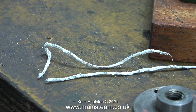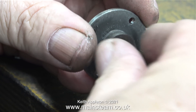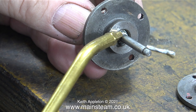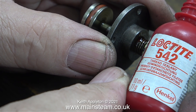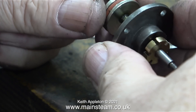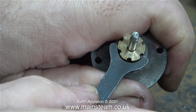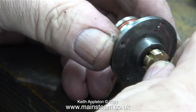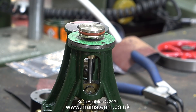The last piece of gland packing that I used was a bit short so I've cut two slightly longer pieces. I'm not going to show the process in its entirety as I've shown that previously. Here I'm fitting the gland nut in place, first tightening the gland nut and then backing it off slightly. Here I'm applying some oil, and with the help of the oil the piston rod moves very freely in and out of the gland. I'm putting a small amount of Loctite 542 on the threads — this is not to seal them particularly, it's just to tighten them up and stop the part from working loose when it's in service. That's one down. Here's the other gland with the unevenly machined nut, and in exactly the same way as previously shown, I tighten the gland nut and then back it off slightly. If you don't do that and the gland is too tight, two things can happen: one is excessive friction, and the other problem can be scoring the piston rod.